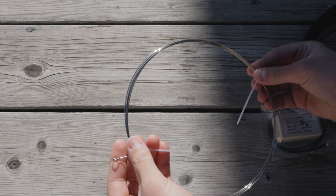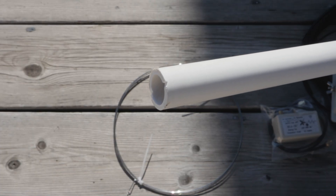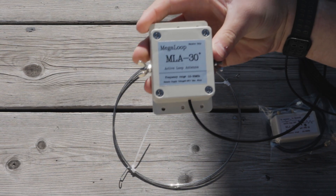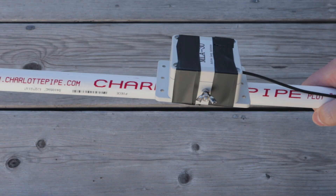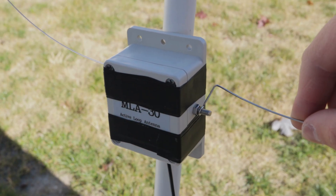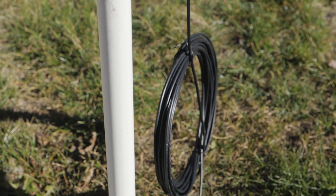What I gather is that we have this loop, and I expand this out — this isn't the actual diameter of it. I'm going to expand this out and put it on top of some PVC pipe. I have PVC pipe that I cut a tiny little notch on just so the wire will sit on it, and it needs to be 60 centimeters diameter. I put this on the base, and these hook on here like that. We want 60 centimeters — meaning the wings on here need to be 60. That's done. Not going to be the most good-looking one; I would have loved to use zip ties but I couldn't find any. Not my finest work, but it'll hold — this is more just temporary, just to test it out. There's the extra wire hanging off, ready to go.